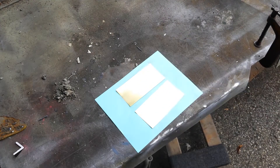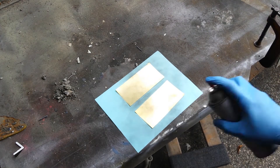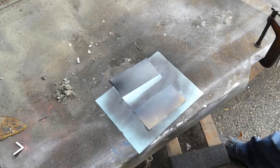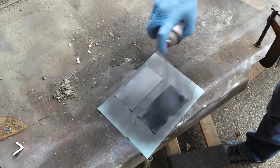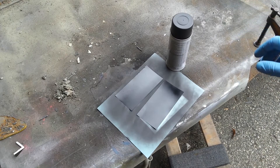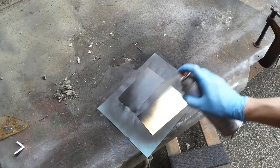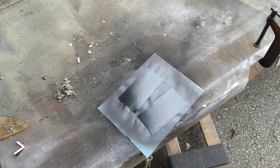We found when testing this process that the cheapest spray paint you can get — the 99 cent stuff — works best. Apply it in several light coats and build it up to a full depth. You have to be kind of careful; the brass tends to blow around from the force of the paint because it's so light. Once you build up the first side, flip the sheets over and paint the other side. Wherever the spray paint is present on the brass, the acid won't be able to attack it, so it's important to put it on both sides.